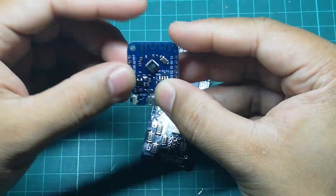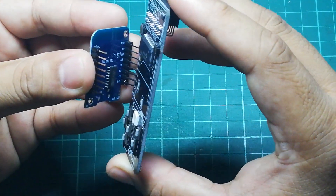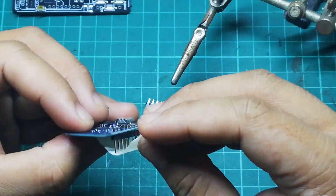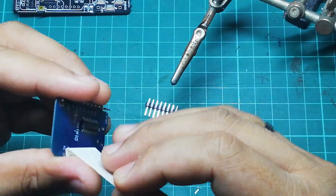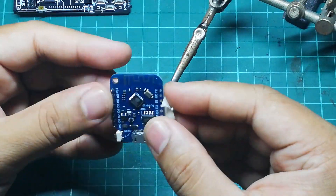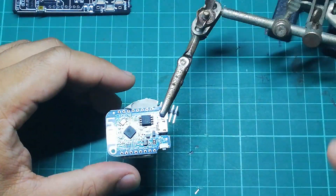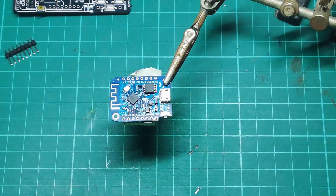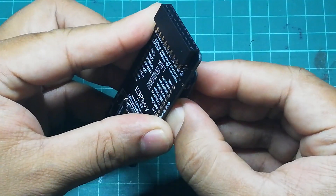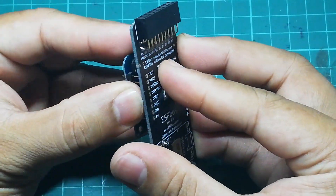I'm testing to see if the components fit properly — this is how it will look. I'm adding some tape at the bottom to keep the headers in place while soldering, because moving headers cause problems. There are different ways to hold things in place; this is just my preferred method. With that soldered, we install the module onto the ESPboy board, and once installed it should sit flat.